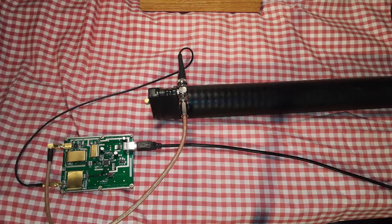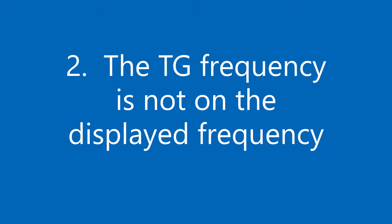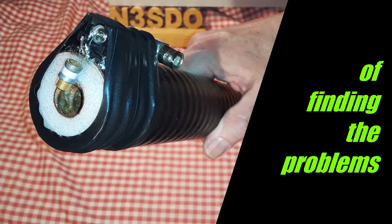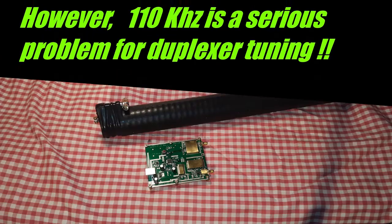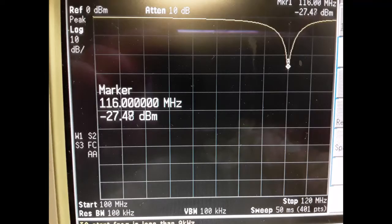Using the Simple Spectrum Analyzer and testing this stub, I discovered two things. First, that the tracking generator square waves coming from the Simple Spectrum Analyzer cause errors in the graphing of the filter response. Second, I learned that the frequency of the tracking generator is not the same as the frequency displayed on the graph. This video describes my testing adventures with the D6 and finding that it has a frequency offset of about 110 kHz. For VHF and UHF antenna testing, this small frequency deviation is insignificant. But if you're tuning a VHF or UHF duplexer, 110 kHz could be a pretty significant error that can affect the performance of the duplexer and the repeater it's being used with.